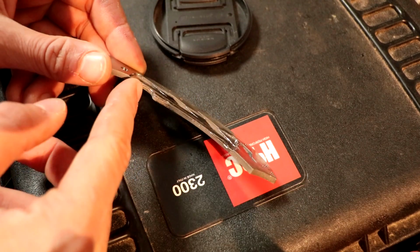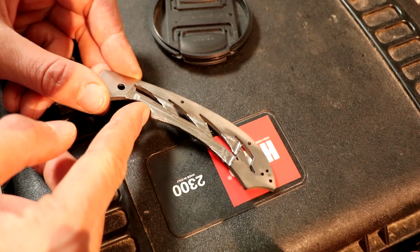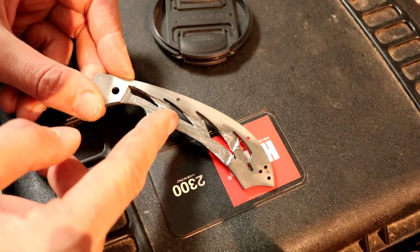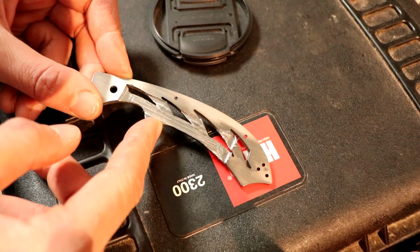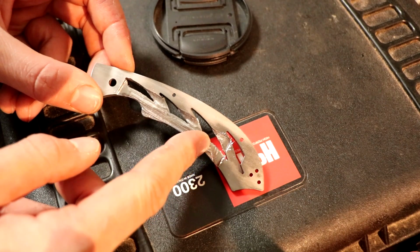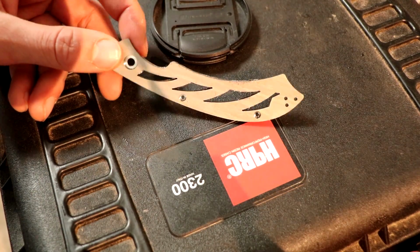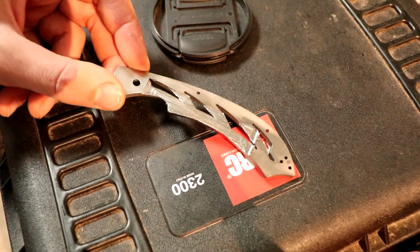Is it my depth of cut? Is it my width of cut? Is it that I use AliExpress end mills in HSS steel, not carbide? Because I made a mistake and ran into my fixture, and there I had these beautiful chips. I removed way too much material at once, but there it was all fine, and here it's difficult. So I'm going to take a bit deeper cut and then go back and forth, but yeah, I'll just finish it. But if somebody knows the answer how to manual mill titanium, please let me know.